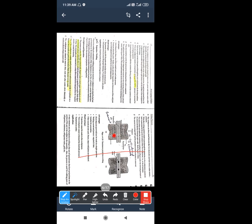Now you can see the workpieces over here. One workpiece is fixed to the fixed shaft and another workpiece is fixed to the movable shaft or the cylinder. For the movable electrode or cylinder, the workpiece is made with embossing. Embossing means, you can see over here, there is a dome shape given. The two embossing shapes are there, where at the top there is a gap from where the pressure is applied, and only this part comes out from the surface of the workpiece. That is called embossing.